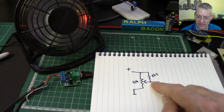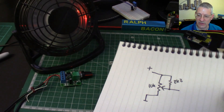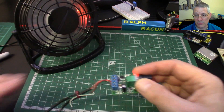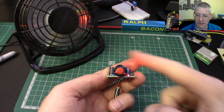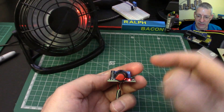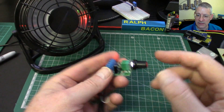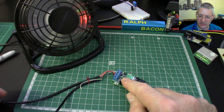On a hunch I tried it and lo and behold it works like a dream. I didn't just choose 2.2k out of the box — I put a variable resistor in there first, maybe a 50k or 100k, and just turned it until I got the results I wanted, and it happened to be a very low resistance of 2.2k. As you can see it works like a dream now — I can take it down to minimum and it still runs, very very gently. Halfway — that's not bad. Full power is full power. I put that on the scope, so let's have a look at the waveform generated by this device.